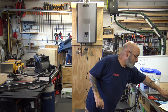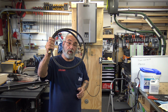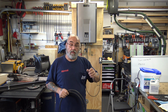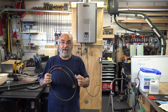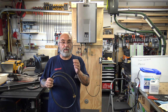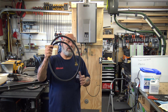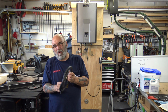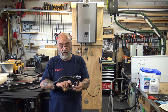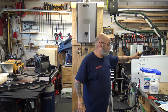Oh, one other thing. For you guys doing it in your business, use only these rubber hoses. Don't use the braided hoses. The vinegar and the solution does something to the braid, and it brings out the braid and it becomes like needles, so you cut up your hand real good. If you're doing what we do, you're going to get only about 6 months, maybe a little more out of it. These are not expensive hoses. They are pressure rated, but not like the braided ones, which are higher pressure hoses. It's not worth the money, and like I said, it kills your hands.